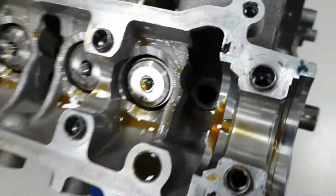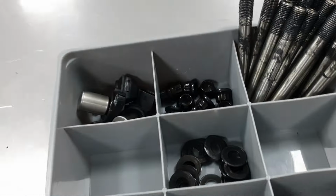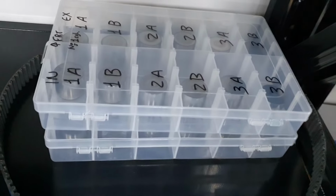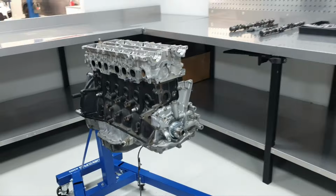Comes outside, studs out. All right, comes out here. Studs are here. I'm removing the sensors because I'm going to put the cylinder head sideways. I don't want to hurt any sensor. The buckets, pockets in order here inside. All right, classic, the rest of the parts here. You saw it earlier. Now, let's pull out the cylinder head.